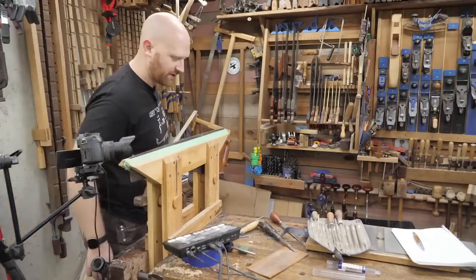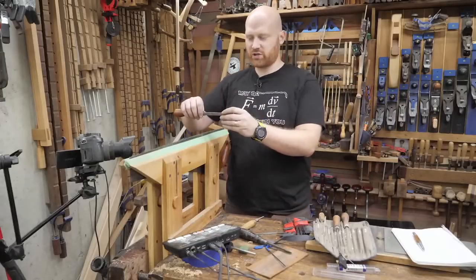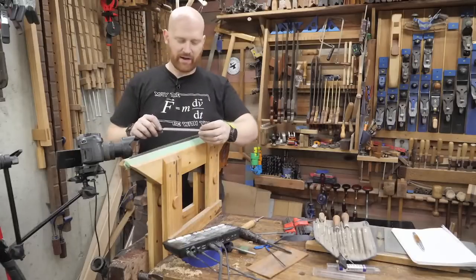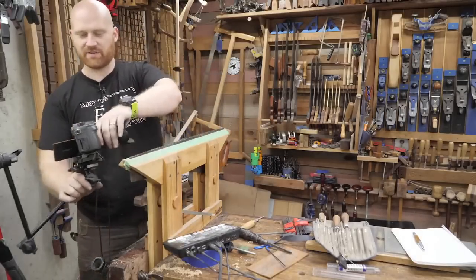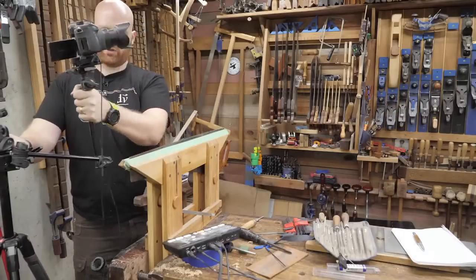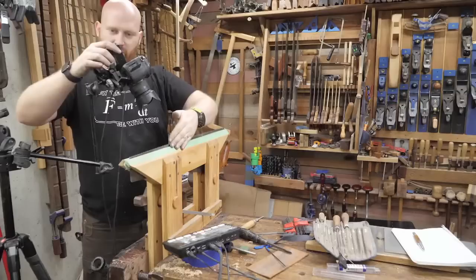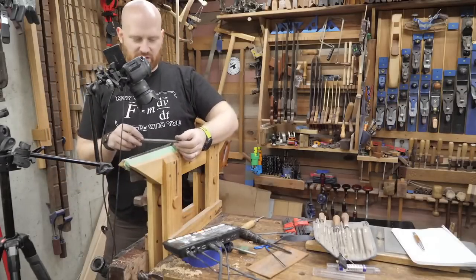The next question then is, now we've picked the right file, we need to know what orientation. Now when it comes to rip teeth, that's perfectly fine because the file needs to be 90 degrees to the plate. If it's crosscut, then you start putting in some fleam, which means it's no longer 90 degrees, it's something else. So let me show you what I'm talking about here. Back up, we don't need to be quite that much. There we go. So what we have is the rake.